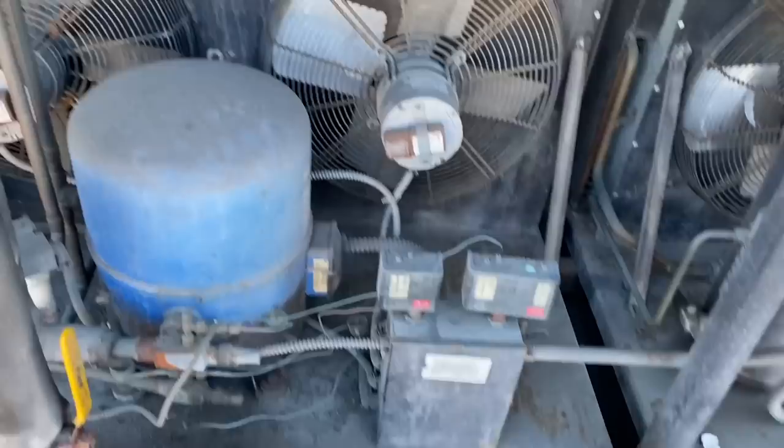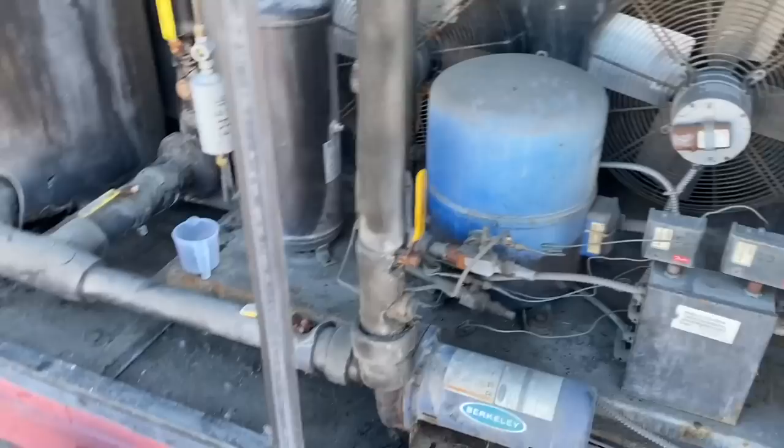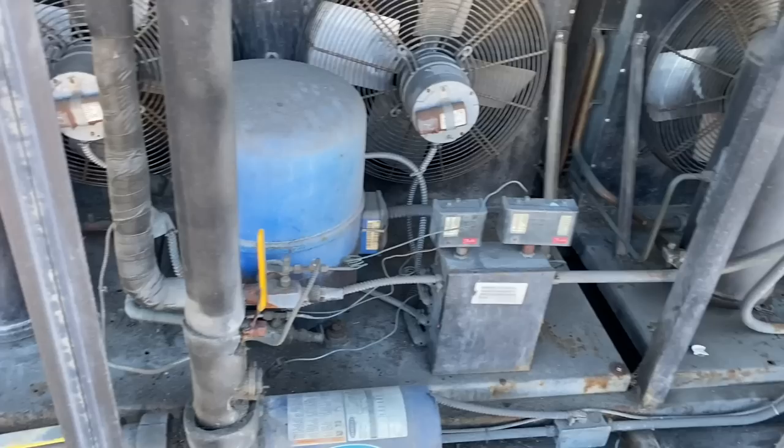The chiller pump — somebody's hot-wired it, it's just in full run mode, and I don't think it's pumping. The whole volute's hot. We were pushing glycol through there, it'd be cooled down, but you can see the plates are starting to ice up and the compressors were flooding back. This is the circulation pump through the heat exchangers back to the tank, and I think this pump is not pumping.